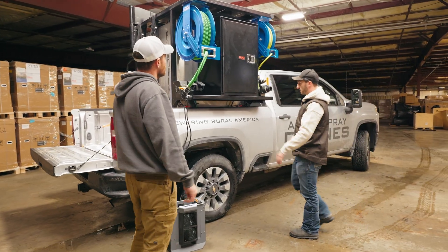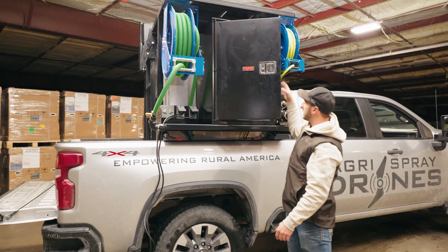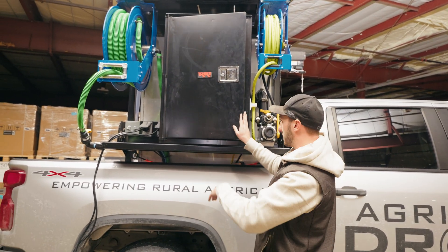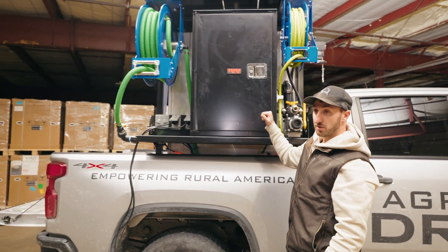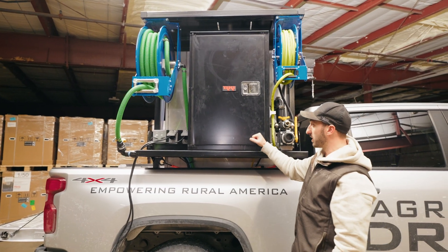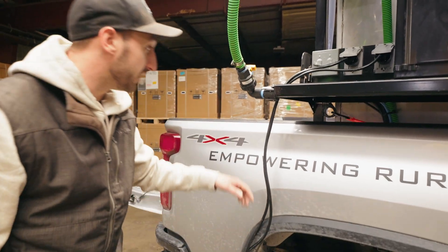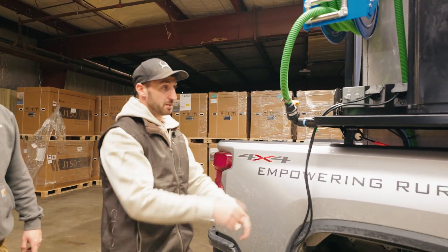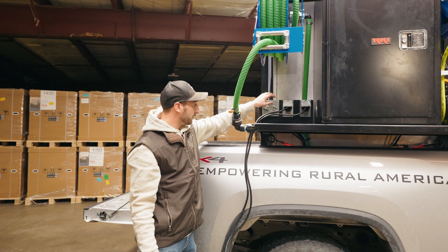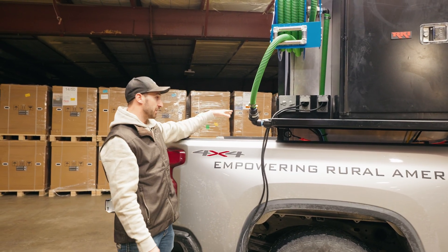This is my favorite part — this is your workstation. I put it on the passenger side of the truck so if you're on a busy road, you're not working right next to where cars are driving. It has enough space to put your charger, all your batteries, and your remote controller box. It's 18 by 24 by 36 inches high, so you still have plenty of storage just like the old Roadrunner, but it's no longer designed to work out of a toolbox. We've got two 30-amp twist locks to plug into your J-150 charger. You can run this off the ground and out of the box of your pickup. Your main pump switch is right here and your fresh water pump switch is right here.